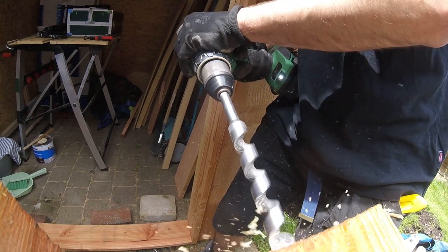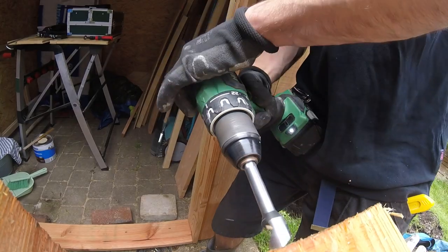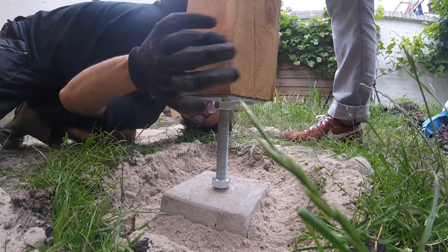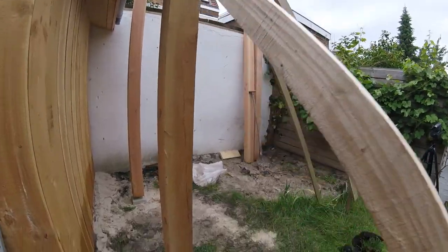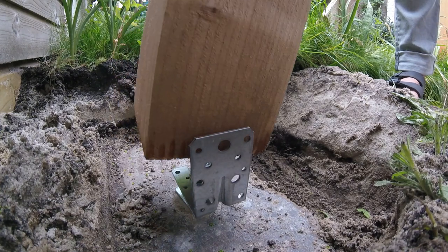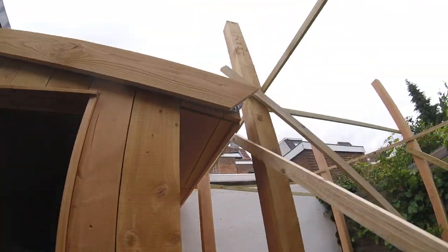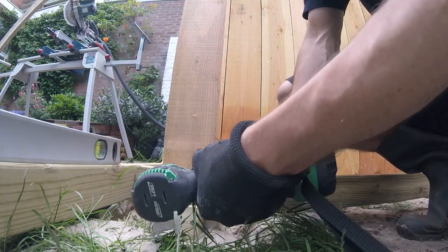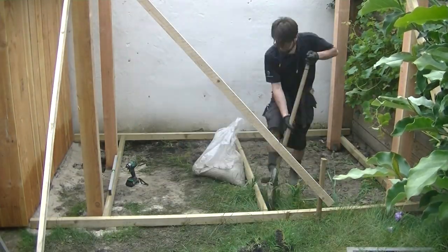In the square beams the pockets need to be drilled and the spur plate mounted — all the wood material is Douglas. The slots and the beams are held plumb and upright. Now the bearers for the deck could be attached; these will be carried by the beams but also sit on concrete piers on the ground. When the frame is nice and level all the elements can be added.